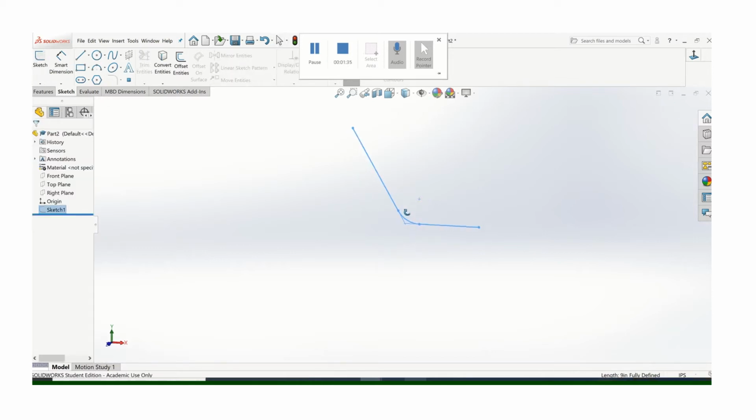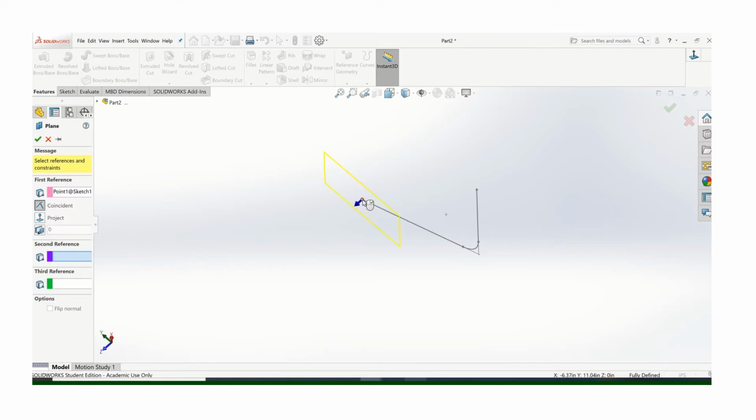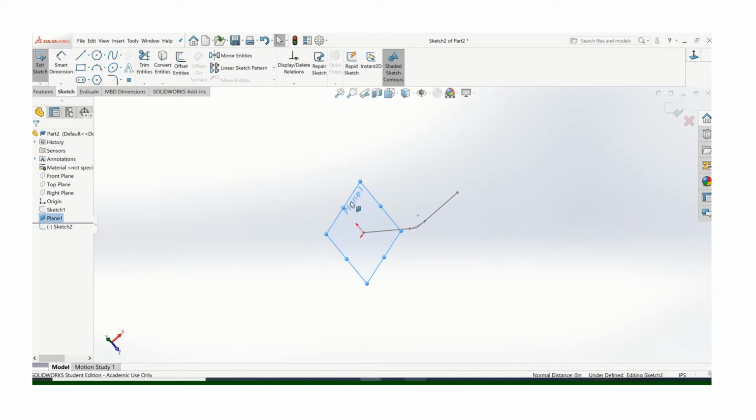So there's my sketch of the path. So now I need to put my cross section in there. So in order to do that, I'm going to need a work plane. Go to features, plane. Now again, the way this works is click on the endpoint of that path and then click on the path itself, and that'll give you a plane that's perpendicular to the path that you can sketch on. Alright, so we want to sketch on there. Control 8